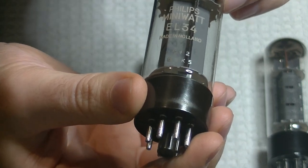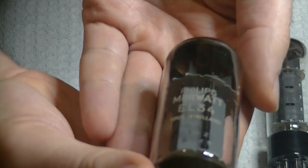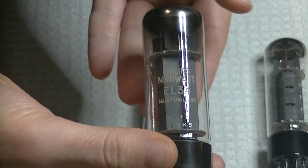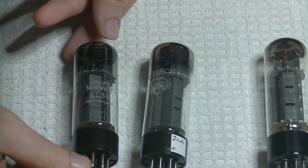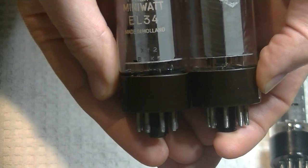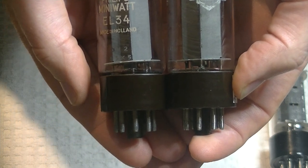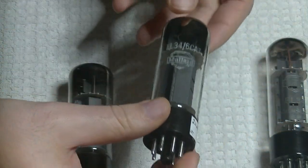You'll also see differences in the getter rings. Mullard made them with a single ring getter and a double ring getter on the inside. Now look at the label - what is Philips doing with the MiniWatt label on top of a Mullard EL34? Well, Philips owned Mullard, so it's not unlikely you'd see a Philips-branded Mullard tube - in fact you see them all the time. The Philips tube would typically have a very dark brown base, while the Blackburn plant tube labeled Mullard would have a black base. A very small difference, but otherwise these are identical tubes.